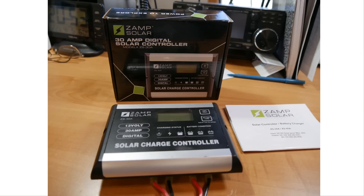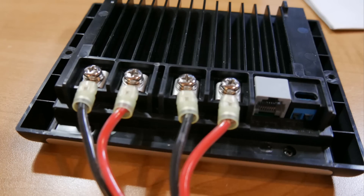This other charge controller is a pulse width modulator designed specifically for RVs — it's 12 volts in and 12 volts out. I can take one of my 12 volt panels like that 50 watter out there and take that with us as we go camping to help keep the battery charged in our travel trailer. This is what the back of it looks like — it's designed for a more mobile environment. There's a little RJ45 socket there that's for a battery monitor.